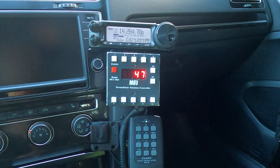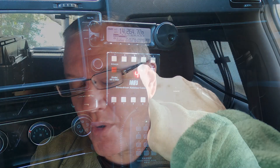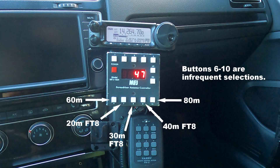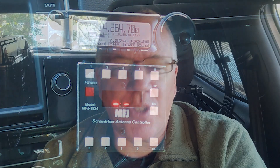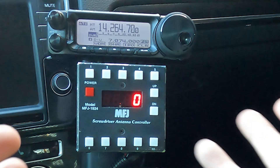It would have gone to 47 if I had just pressed the 2 to go to 20 meters. Here's how I have it tuned: 1 is 17 meters, 2 is 20, 3 is 30, 4 is 40. And 5 is 75 meters. I used to have 1 stored as the stow position, but I discovered I can just press and hold the two buttons to reset it — it'll drive to its lowest position and reset my counter. That way the antenna is already reset to zero, and any missed pulse counts are cleared out.